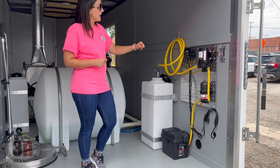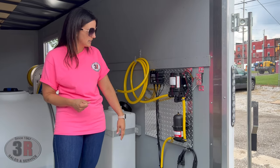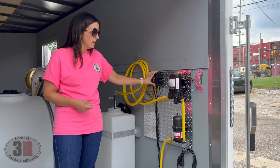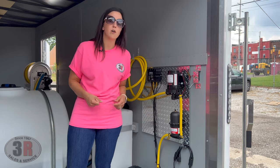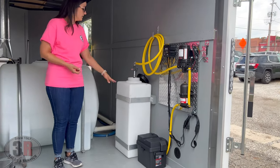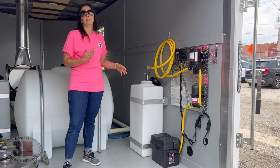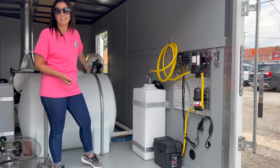With that, we have our 12-volt pump — it's 7-gallon per minute, 100 PSI. We've got the accumulator and the charger system for it. The on-off switch is right here, easy to access. We've got our plug at the bottom so it can be charged, and the battery that powers it. The dipstick assembly goes down into the tank and pulls the chemical he wants to apply. When he's ready to rinse out his system, he just takes that dipstick and drops it into the water tank to clean it all out.